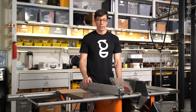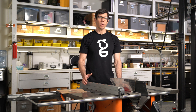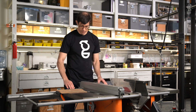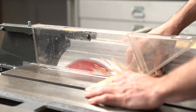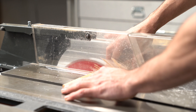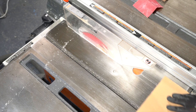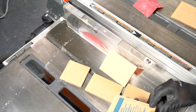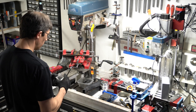Now I've worked out the sizes of the pieces that I need. I'm going to start making my cuts using a table saw with a saw blade made for cutting metal — it's got the same tooth pattern as blades made for cutting plexi and does quite a good job. When cutting or drilling plexi, especially if you're drilling a lot of it, you're going to want to open a window for ventilation because the fumes can give you a headache. Our first cut will be four inches.